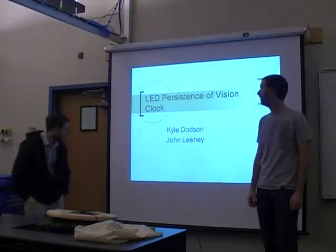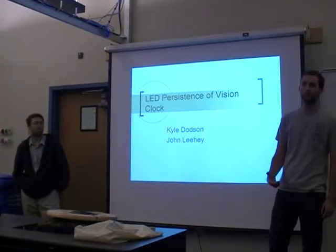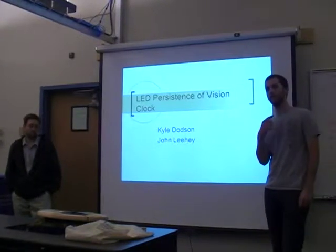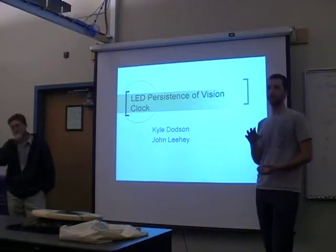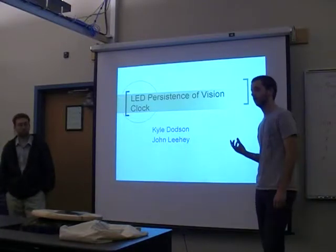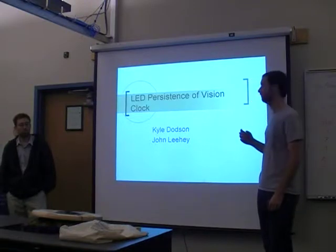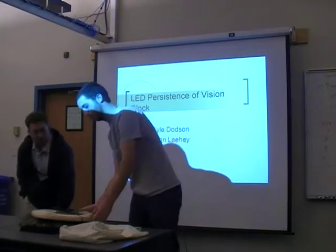Our project was an LED persistence of vision clock. For those of you who don't know what persistence of vision is, it takes advantage of the fact that your eye can only see at 16 frames a second. So basically, if you flash an LED at like 50 frames a second, it'll look like it's constantly on. Our project used a spinning disc with LEDs behind it, as you can kind of see right here.